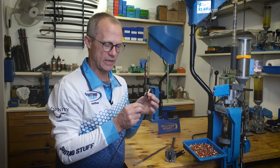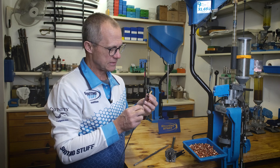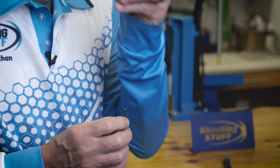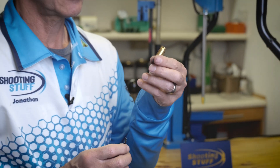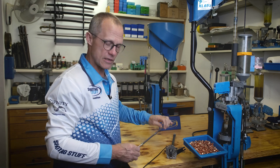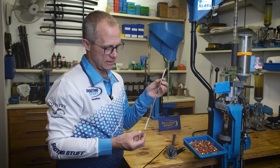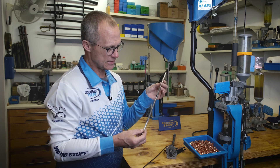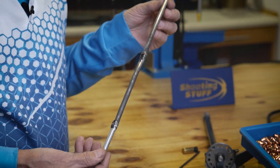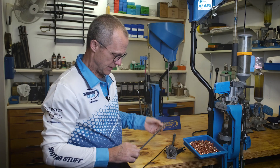Let's see why we don't want to make a projectile out of the follower rod. In the event of a detonation, this heads skywards — a single piece will bounce around and cause harm. The reason it goes skywards is when the primer magazine is detonated for a variety of reasons, the inside magazine ruptures, the follower rod ejects outwards, and it's generally a big mess.